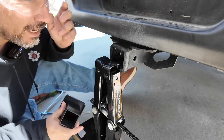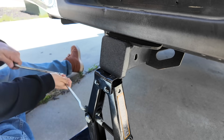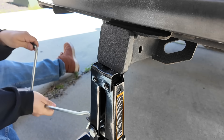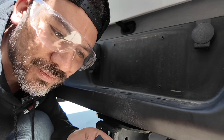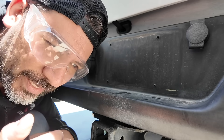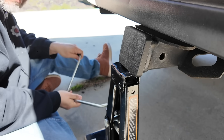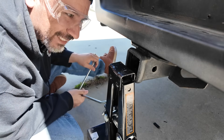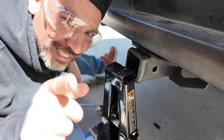Next we have ASA. It maxed out at 41 turns and the ASA held all the way together — I was able to fully extend the jack without being able to rip it apart, where all the other ones failed. We went back and tested PETG to its maximum as well, but we could not max it out — it broke in different sections without a clean flat break. ABS had an almost clean break in spots. ABS GF nearly completely broke. ASA was the clear winner.